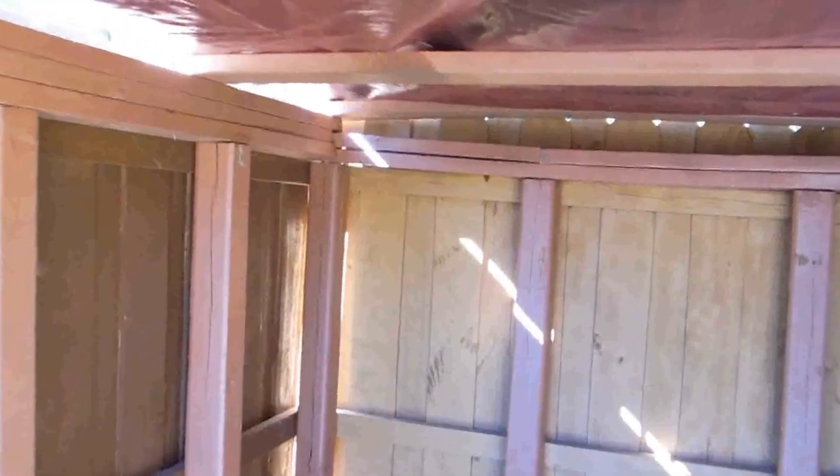This is just a little under 6 feet wide, and the tarp is measured 6x8, so I need to see about 8 feet — it'll probably come up to about here. I'm going to lay it out and make sure I put this last board in the right place. I just threw the tarp up here to see how it kind of fits. In between here I'm going to cut a 22-inch 2x4 to cover this gap and nail it down.